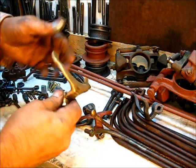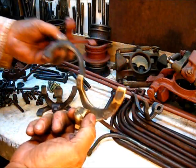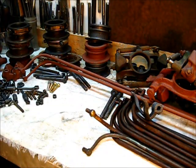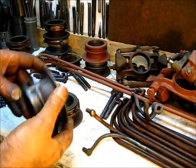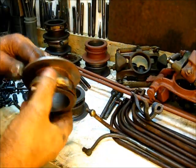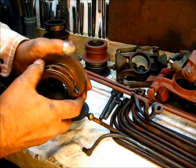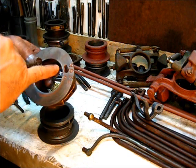This brass example here was actually on an original engine — factory original equipment, a brass shoe. There's documentation confirming it was original. The collars for this part: the early ones did not have the brass collar that rotated in here. The reason they added that collar is so that all this mechanism could stay stationary — the collar stays stationary and the other part turns.